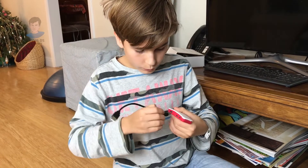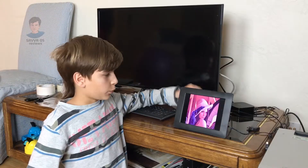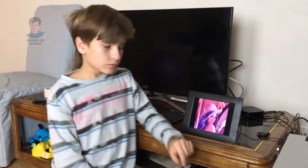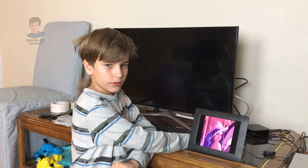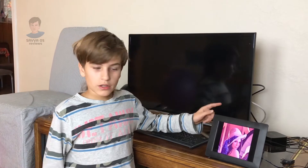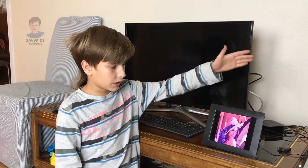We managed to put everything into one case — the Hologram Nova and the Raspberry Pi connected. Now we're going to connect the USB to the Raspberry Pi. We have connected our Raspberry Pi with Hologram Nova to the digital frame, and right now it's showing a picture that came from my dad's computer all the way in the other room, transmitted through the Hologram Nova to the screen. The distance doesn't matter because it's connected through the mobile network, so this can be all the way in another country and we could still send pictures to it.